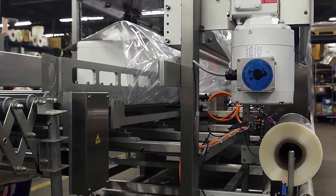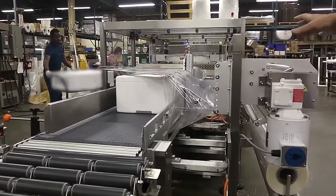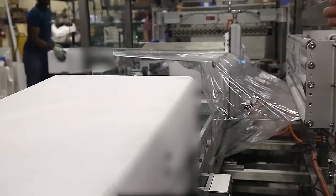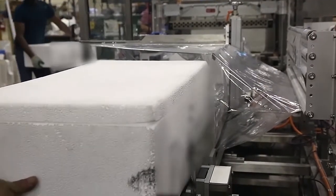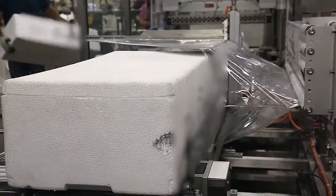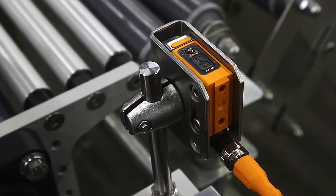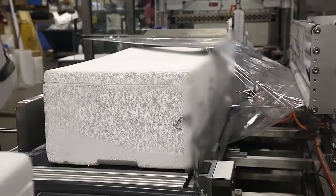At this stage the package is fed into our input conveyor so the package gets wrapped into the polyolefin film. They want to conserve the image as best as they can, so the best idea was to wrap these boxes in plastic. The sensor detects the package and the speed is based on the line speed — when a package comes on our line it triggers our sealing and bagging process.